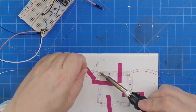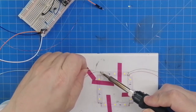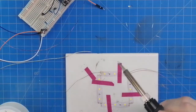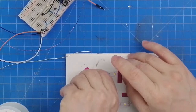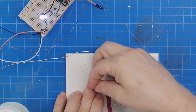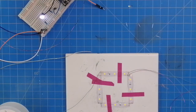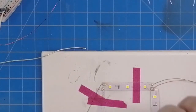It's kind of funny that one side is the only side that's heating hot enough to melt the solder. And this sometimes can be a pain. Oh, that's hot. So what I had to do just now is the wire itself was sticking out over the side of the pad, and so it refused to bond in the middle of the solder, which is what I need. So I just pushed it over. Usually I will grab my tweezers and do that. This time I used my finger and it got hot. If you look right there, the wire is running pretty much over the center of the pad.